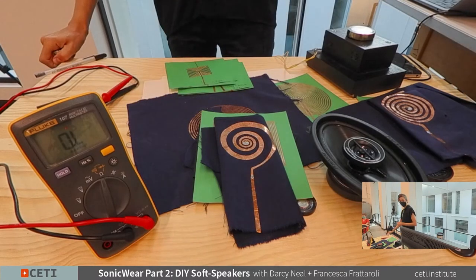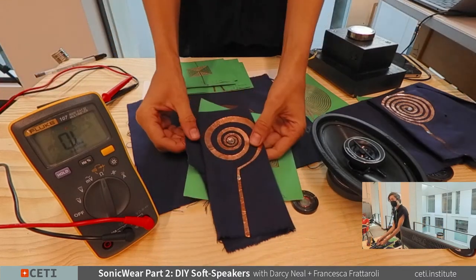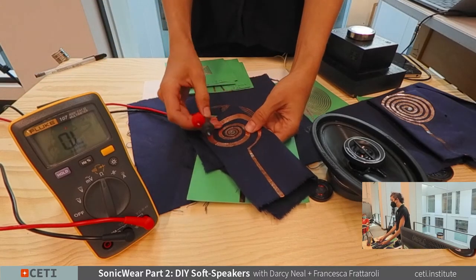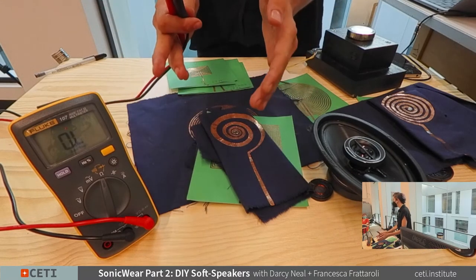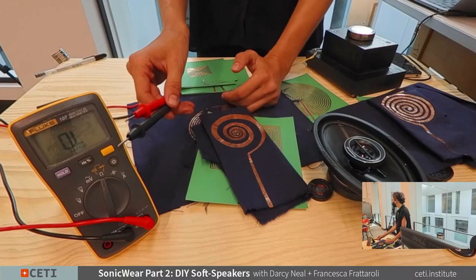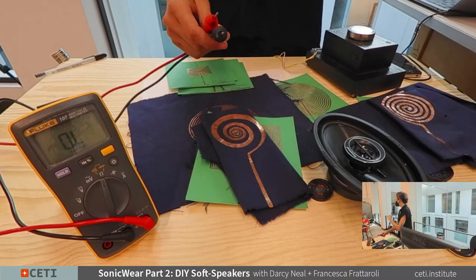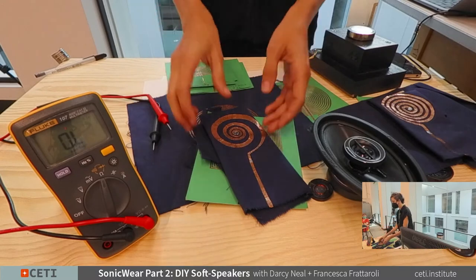Sweet. You saw me measure some of these on camera, so you get the concept. Some multimeters let you set the resistance range you're looking for. We can always demonstrate that in the future, or you can look up online how to do that. Whatever multimeter you have access to, some of them auto-calibrate like this, but some of them you need to set so that it's measuring the range of resistance that you're looking for. I can show you an example later on if you need clarity on that bit.